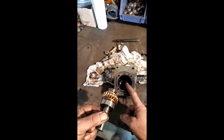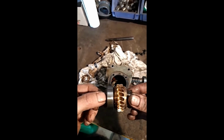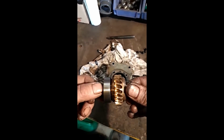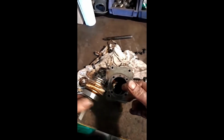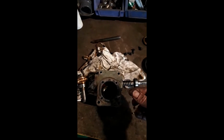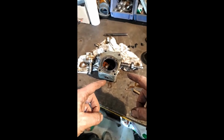I don't know for how long, mind. It didn't have much oil in here and it was leaking, so the chances are this has been running without oil, and as we know, that's not good for any metal components. Hence it's probably had rapid wear. However, it is an old machine, so things are going to wear anyway, but just accelerated with no or little oil. Right, so I'll switch this off now, get this put back together in the opposite, and see how we go.